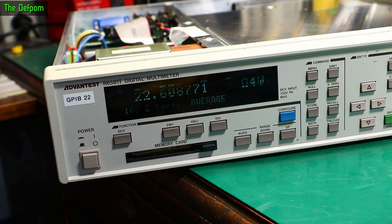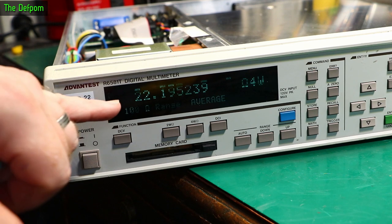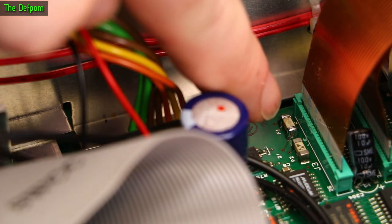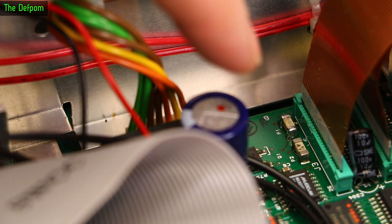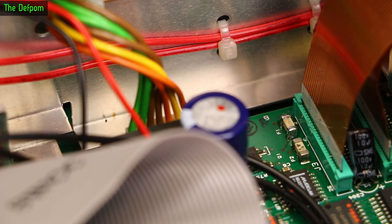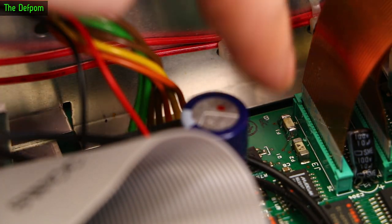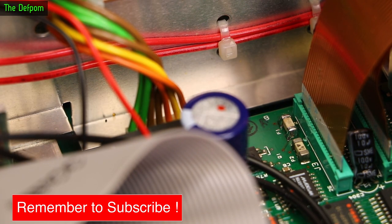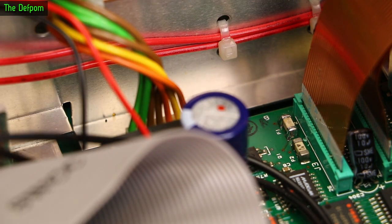As you can see the display is working okay. It is rather dim, but that's an issue with this particular display — it's a dim display, which is a bit of a problem, but it's working at least, so I'm happy with that. The fuse I replaced is F1, which has an 11-volt AC power supply running through it directly from the transformer, and that's what drives the actual display itself — the VFD. So that's why it blew. For some reason the VFD was not happy — maybe an in-rush current thing. So if your VFD ever doesn't work, replace F1, or at least check it.